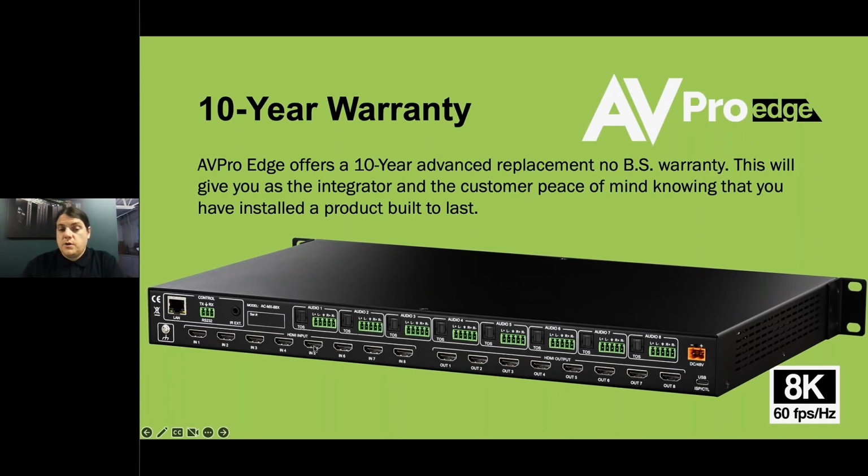Let's say you were coming in input 5 and you're going out audio 5. You would not be able to get 5.1 through the Phoenix, but through the Toslink you can, no problem at all. Now let's say that audio 5 had a 2-channel source going into it and you weren't going to use this, you still wanted to use Toslink, no problem. That Toslink is going to pass 2-channel absolutely with no problems at all. It's just going to also allow you to get those 5.1 signals up to Dolby Digital. So great question, Michael. I really appreciate that.